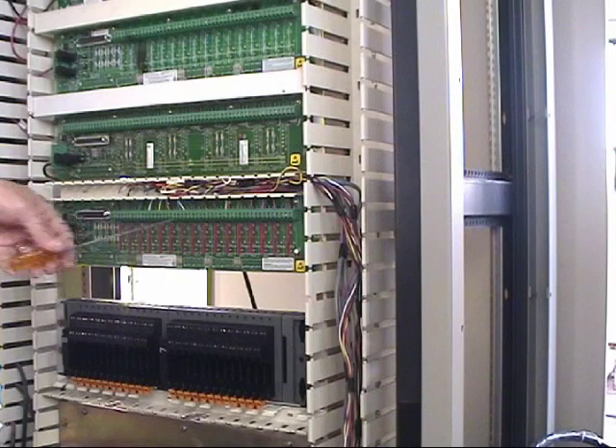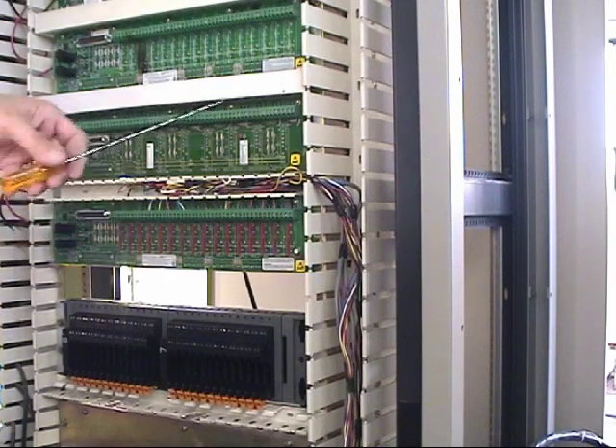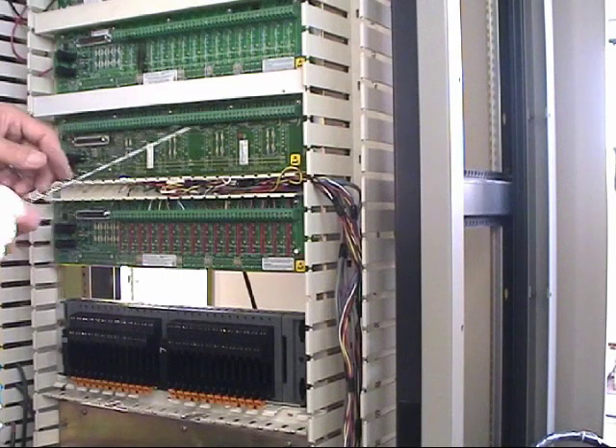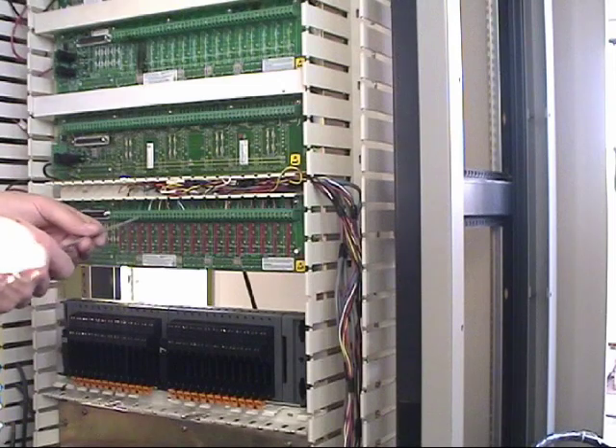When we remove this panel and add another Charms I/O rack, we'll be able to continue on this rack. That way, it keeps all of our I/O in sequence as it was when it was removed from Provox, so that when we migrate the I/O database through our bulk import tools, it'll be easier to accomplish that.